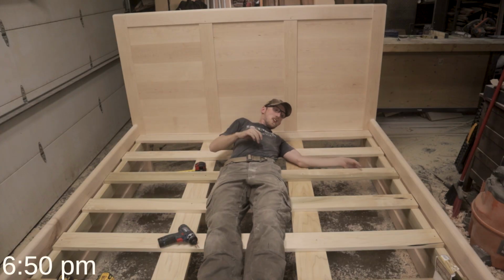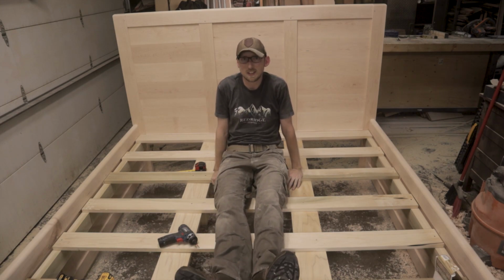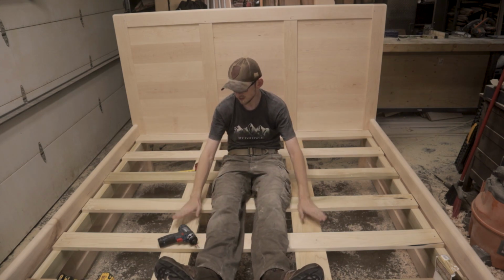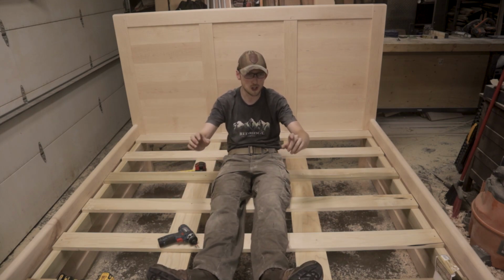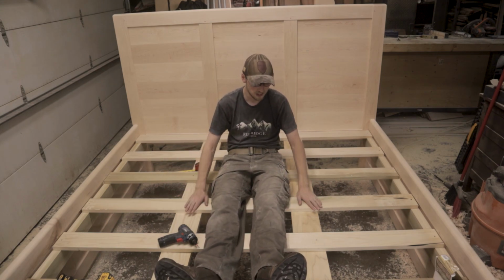So we have an almost fully functional bed. The last thing that we need to do to this, that I'm going to save till tomorrow morning because I'm exhausted and I need to get out of the shop tonight, is we need to add some blocks under these rails, under these middle rails on the footboard and the headboard. So you'll just have to drop these two rails on top of those blocks that we're going to screw in and then you'll put your slats in on top of those,